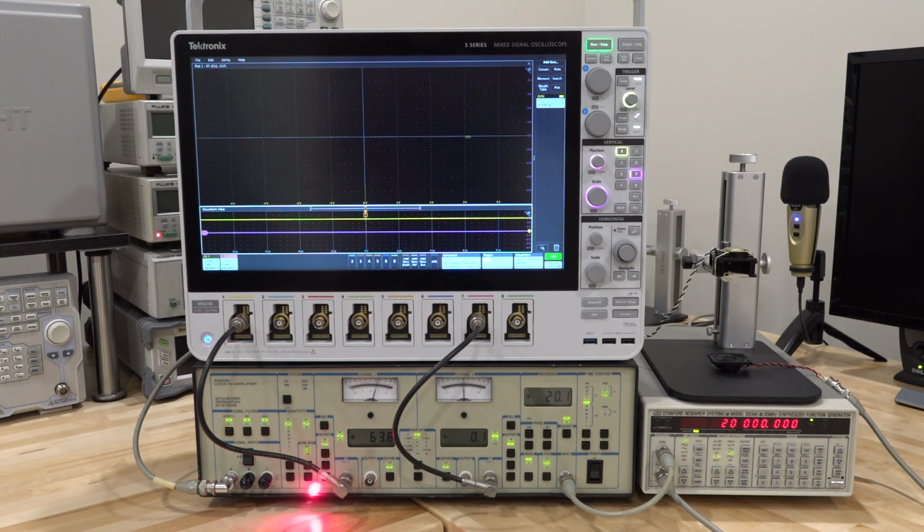So by looking at the output X and looking at the output Y, I will be able to get the exact relative phase between the signal from the bottom and the top speaker. And that's exactly what I'm looking for. I'm looking for catching 360-degree phase change. So I will look at the two outputs of these two signals, and I will look for 360-degree phase change as I am changing the distance between these two speakers. And since this is in a nice apparatus, I will have a very repeatable measurement.